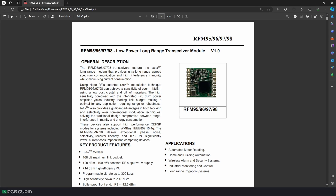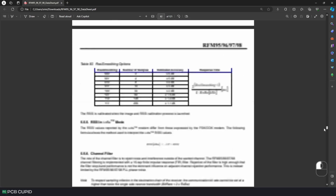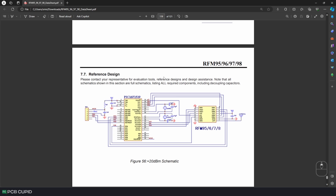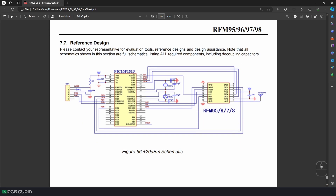Now moving further, we'll follow the same process for the LoRa module. I pulled up the LoRa datasheet and tried to find the application diagram or something similar that explains the connection of the module with a microcontroller. Most of the circuit shown is just the setup for the microcontroller, and only a tiny portion is for the LoRa — just the SPI connection and a capacitor at the power supply.